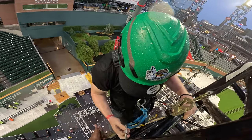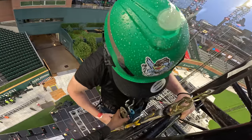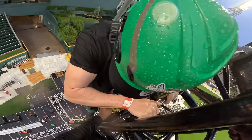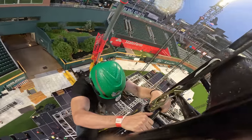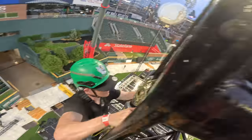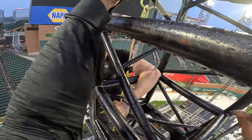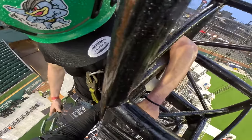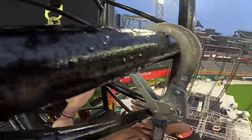You don't even have to put that on right now. Just, oh yeah, you're right. Bend over a little bit. Or if you can get a little lower. You can right there? I'll clip it on you, yeah. So yeah, you can take your lanyard off now. Now with the rope grab, I'll show you. You want to squeeze it like this. Squeeze it up and then you gotta push it down. That's how you release it going down.